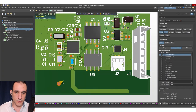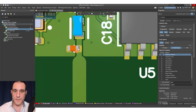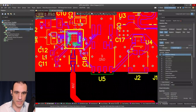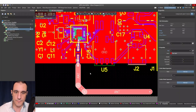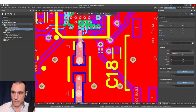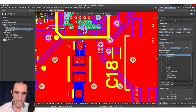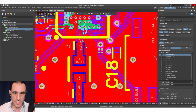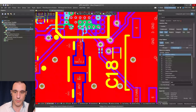Some other cleanup — looking at this in 3D, we actually need to pull off the solder mask on these tracks. There's a very simple way to do that: select all of the tracks that are part of this connection using the tab key, copy all of these, and then move all of them onto the top solder mask layer. Those shapes are all going to be replicated onto that top solder layer, and when we look at this in 3D, we can see that all of the copper is exposed. The reason we're removing the solder mask is because it adds just a little bit of extra loss to this antenna, and removing it eliminates that loss. If we were operating at five gigahertz or higher I would say we'd want to avoid nickel plating, but at 2.4 GHz we can certainly get away with nickel plating.